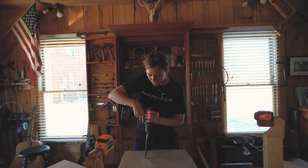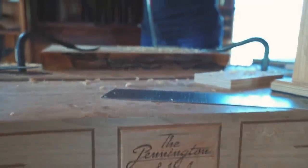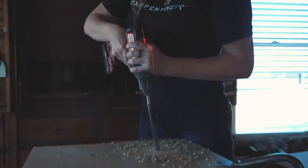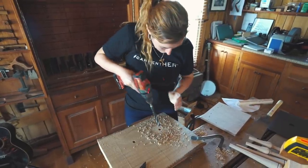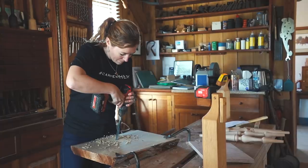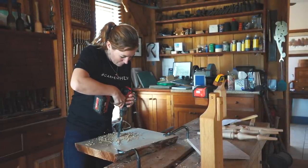These holes are drilled at a compound angle, and Greg has come up with this genius way of making sure the drill is caught correctly, where he's made 2 stands that hold lasers. These lasers can be set to the needed angles. Then once lined up to the hole properly, it creates crosshairs, which you can watch as you're punching the hole. Tell me that's not cool.